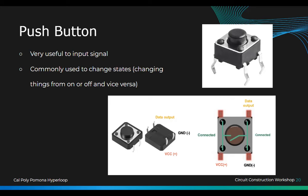So you get your push button, right? It's so tiny. So it has legs like this, right? So how would you put this on the breadboard? I like to normally put it in the center. Remember how I showed you guys the IC chip? I put the two long ones horizontal, and I put the push button on the center of the breadboard. So I would put it sideways, in the middle. It might be a little harder to push in, but you can just press it in like that.